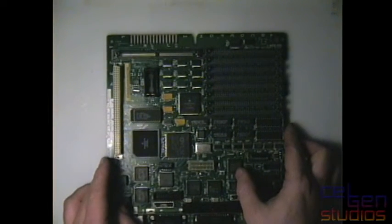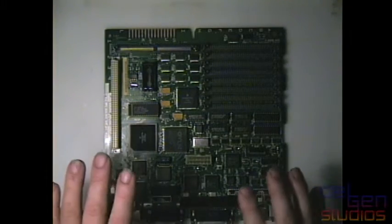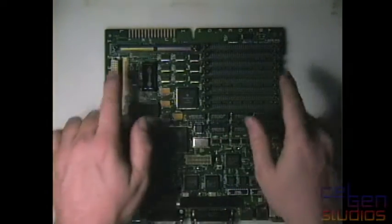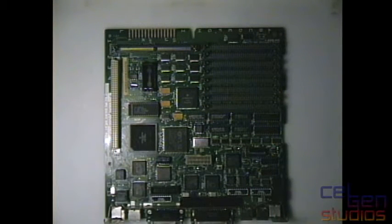Right, okay. Now, for this video here, I do already have the board decapped from my little problem here. And I'll just quickly explain what exactly happened: all of the tantalum capacitors I'd put onto this board were installed backwards. There's a very defining stripe on them that denotes polarity, and I thought the stripe meant negative because I'm too used to electrolytics. They are not. That is positive. So those have all been pulled off.